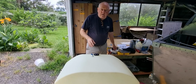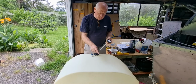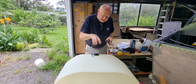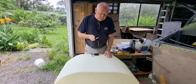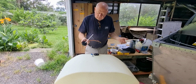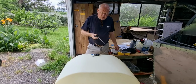The main issue that I have with putting this in is how do I fix it to the top of a nylon tank with a mechanical nut and bolt or a mechanical threaded screw when you're going into, let's call it nylon or poly, whatever the tank is made of. If you tap this, it's probably going to cross thread at some stage if you're removing it a few times. So how do I do this into a tank so that it works each and every time if it has to be replaced? Let's say I pull it out 10 times during the build and recalibrate. So long story short, I'm either going to stuff this up completely and make an absolute fool of myself and create a $500 mistake to buy a new tank, or I'm going to look good.